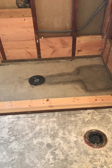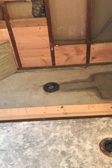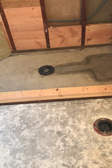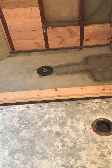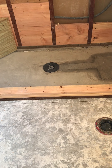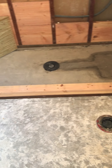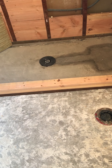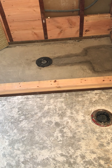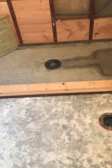Let me talk a little bit about the curb. The bottom piece is pressure treated over slab, which is kind of typical. I use very dry pressure treated lumber — I would never bolt in a wet piece. A lot of times it comes out of the lumber yard kind of wet and heavy. I let it dry out, make sure it's straight, make sure I've got two really straight dried-out studs to stack on top. Pressure treated is fixed to the concrete with half-inch by three-inch redheads recessed down into the wood, going into the concrete about two and a half inches, tightened down real snug.